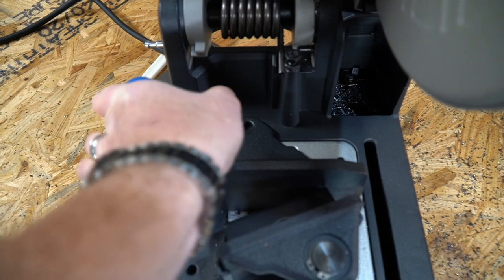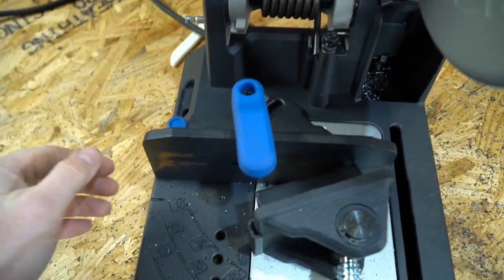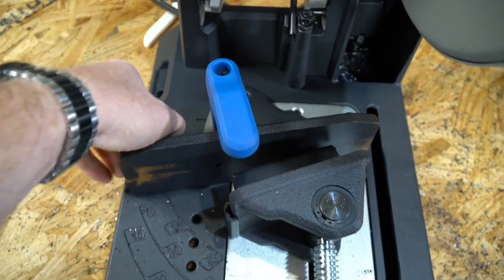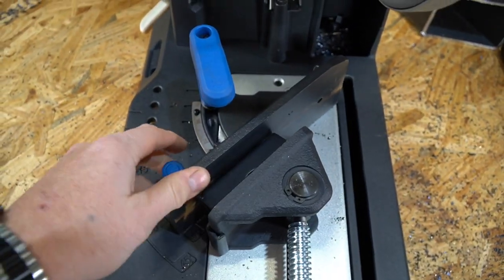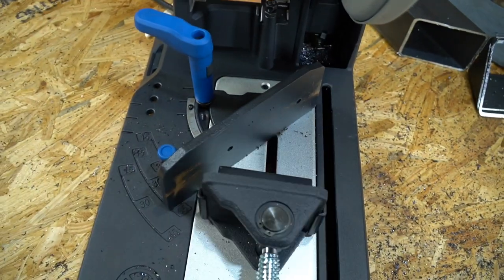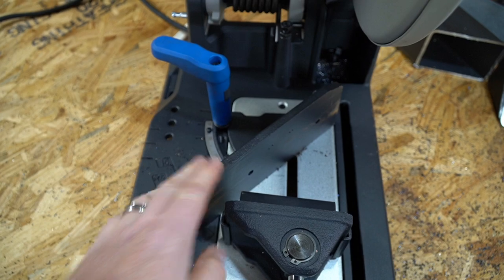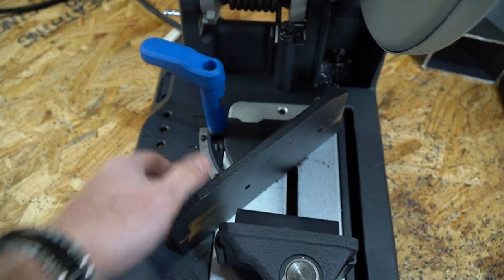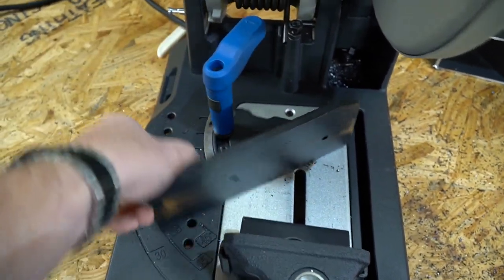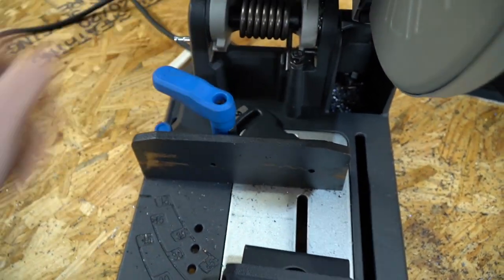They still have a handle, but it sits a little bit taller so you can get to it. There's a pin here — you can pick this pin up and lock it into a 45, then tighten the gate down again and you're ready. It's very cool and very handy. That way you're not constantly measuring your 45s, and if you want to make it straight again just loosen it out, pick it back up, drop your pin in, tighten it, and you're ready to go.